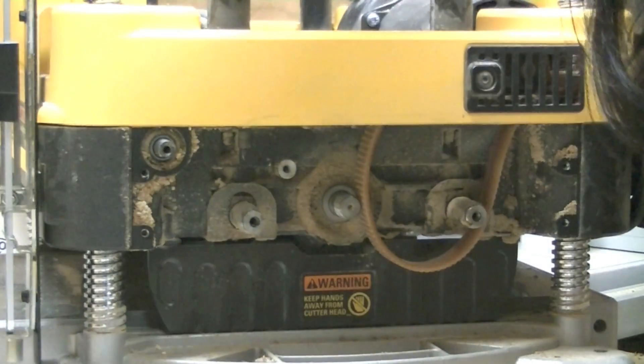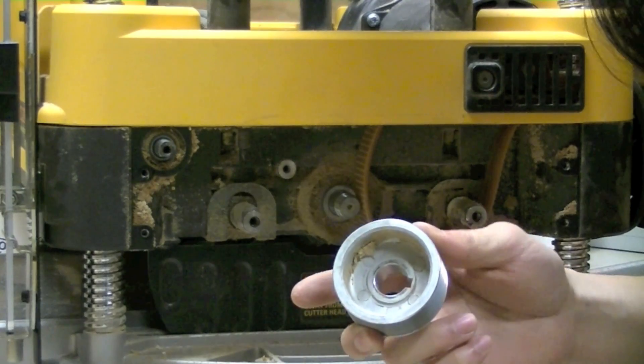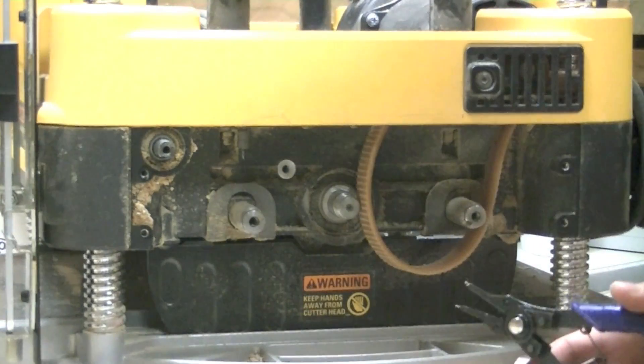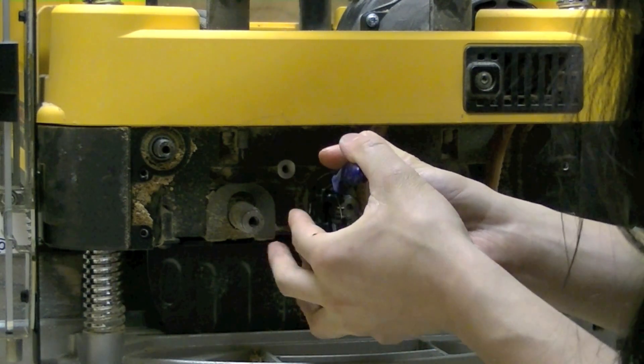That came off quickly. The key I had positioned at the top — this little piece here — that is the key, and it drops into the shaft right on top. I am going to take that out. There actually is no washer in there — there never was. Apparently the model they had when they wrote the instructions is a little bit different. Step 13 is to remove the snap ring from inside this collar here, which is the bearing housing — so snap ring pliers, you've got to have them for this task.